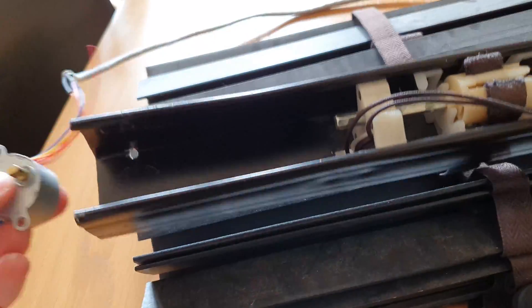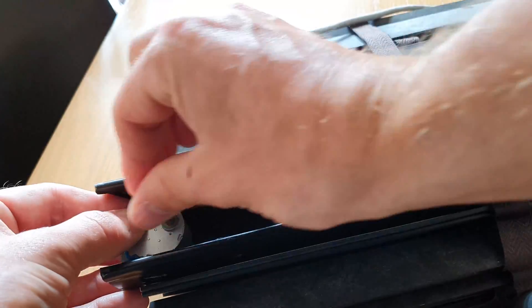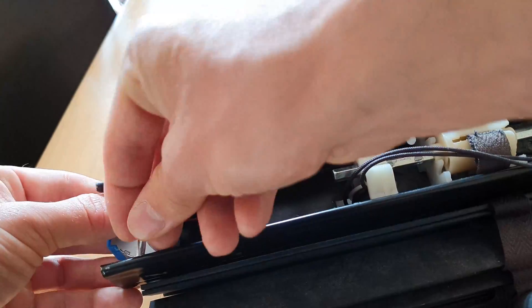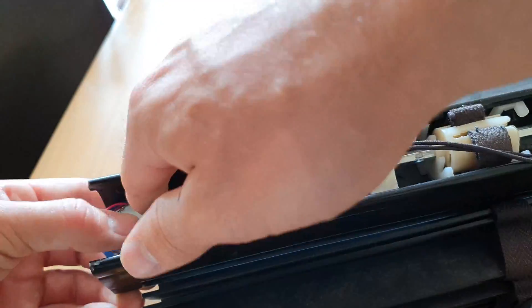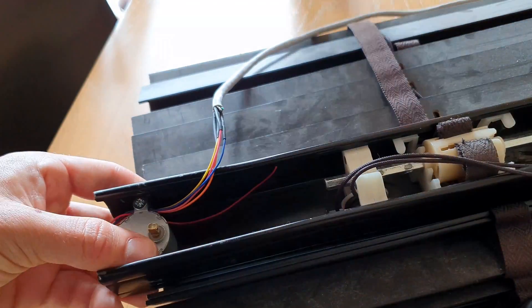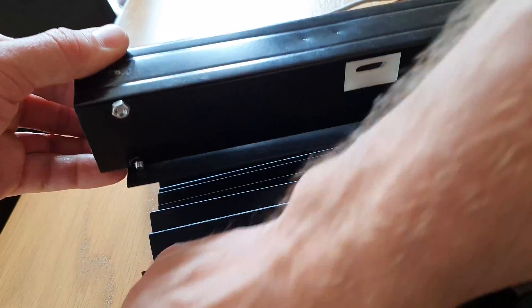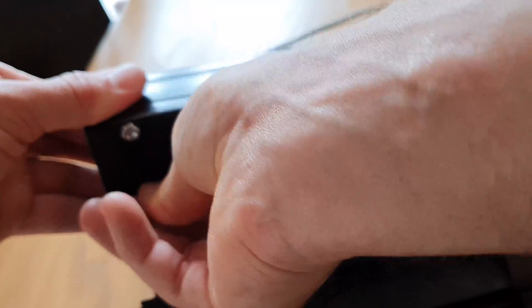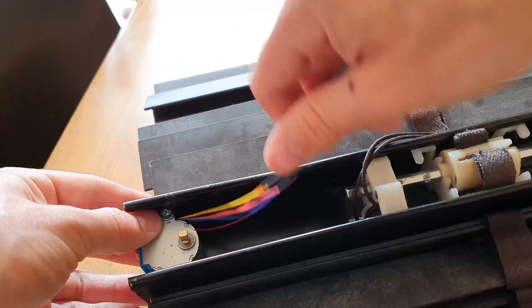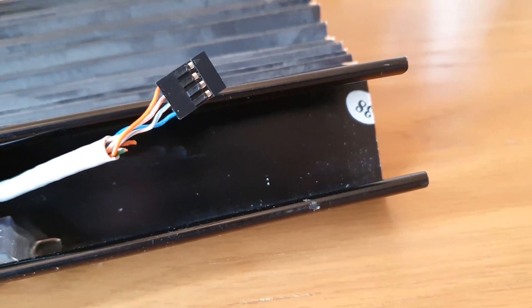With that done we then need to put two 4-millimeter holes into our blind — this will hold the motor down and stop it from rotating. Make sure to carefully mark the holes before drilling so you don't make a mistake. Insert the two M4 screws into the stepper motor and through the holes and tighten them down. Then take the network cable and carefully route it through the middle of the blind all the way to the other end. This might be quite difficult, so one tip is to remove the Dupont connector to give you more room and then reattach it at the end.